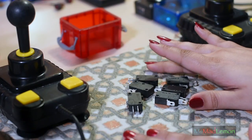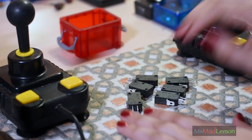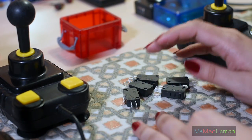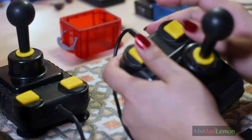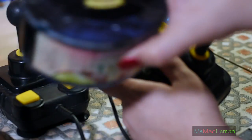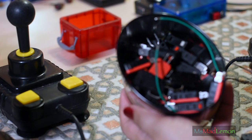These will normally be enough for one joystick — one, two, up, down, left, right, that's four, so six total. However, you can get away with five if you just want to replace one of the fire button microswitches and not the other, or replace it with a spare standard microswitch since I've got lots of spares here.